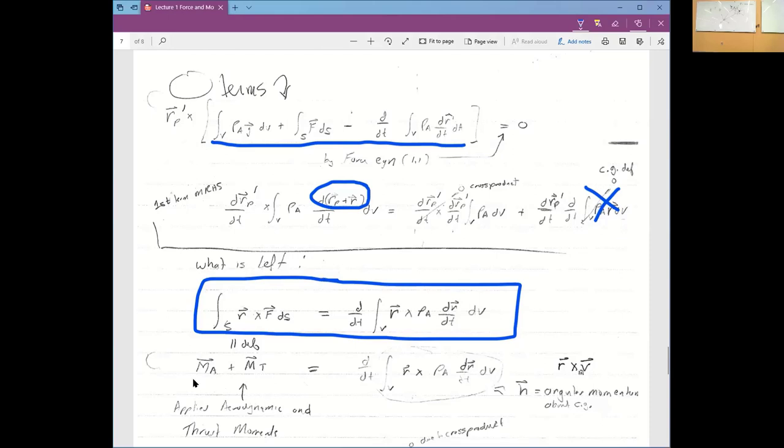And so this equation says R cross forces is moment, so we just say let's collect it all together and call it the aerodynamic and thrust forces, right? R cross F. We get applied aerodynamic and thrust moments. And then this side is R cross M times velocity. And this is what's called angular momentum. And we sometimes call that the H vector.